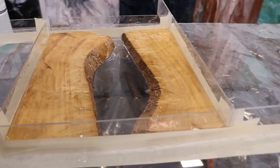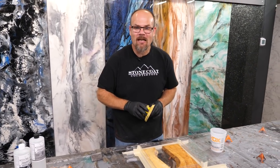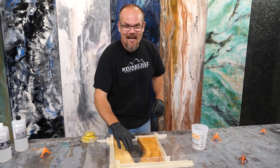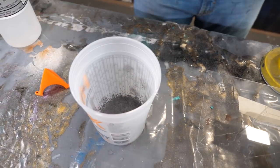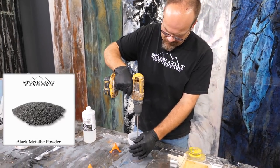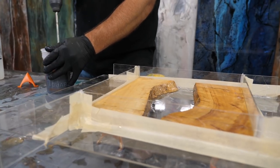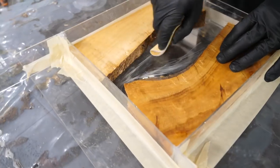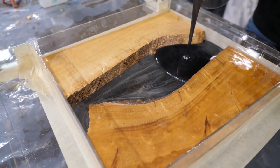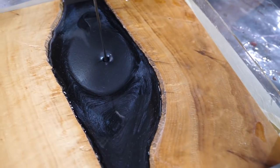Time for the next step on our woodworking school project. We're going to sand that first seal coat with 220-grit sandpaper, wipe the dust, then mix a little more epoxy — this time we're going to fill this entire middle section of our project. I'm actually going to do black metallic in this case. Black and tan — I think it'll really pop and make this lighter color wood look really fancy. Let's torch those bubbles out. That looks really cool — that's a pretty color in there.